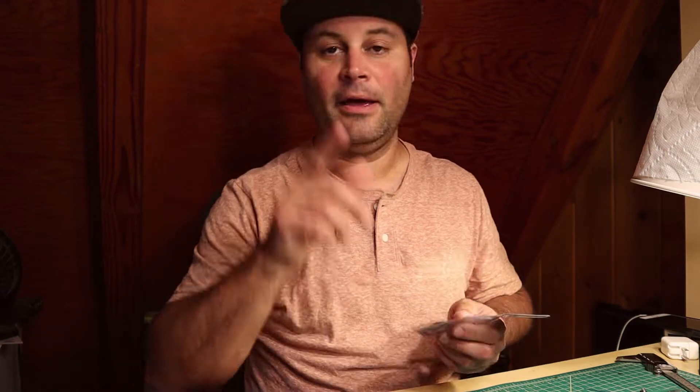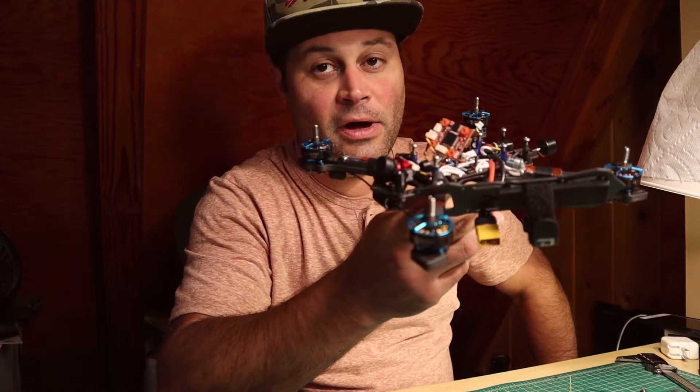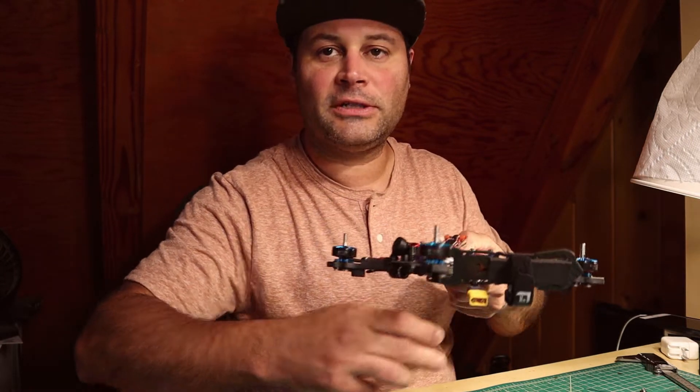Just recently we had a bunch of F1 ESCs, then suddenly people started making F3 ESCs. Now F4 - who needs this? But this guy here still runs the equivalent of an F1 chip. Flight 1 is working up to DSHOT 3200, and for that you need a fast ESC. If you buy an ESC from Flight 1, the new ones are meant and designed to work at DSHOT 3200. It would be very exciting to see if this can actually do DSHOT 3200. I'm sure if those work fine on DSHOT 1200, this should work on 3200, and if not, DSHOT 2400 should be just fine.